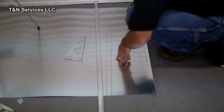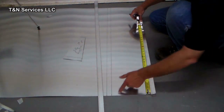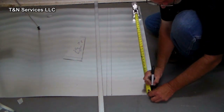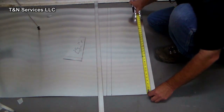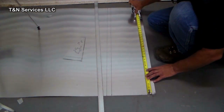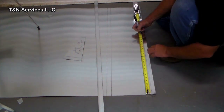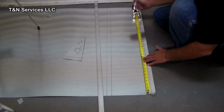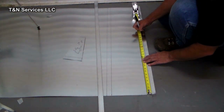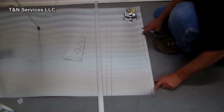The furnace side has to be 19 and a half inches wide, but we're going to put a flange that goes from here to here. So we need one inch for the flange first, then add 19 and a half - that gives us 20 and a half. That'll give you 19 and a half inches from there to there. Then make your other one-inch line, which puts us at 21 and a half inches wide, with 19 and a half inches between the flanges.